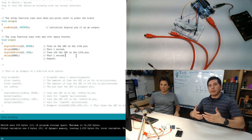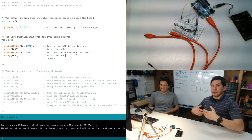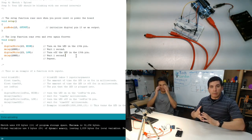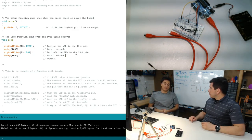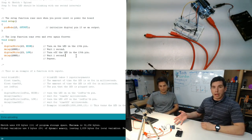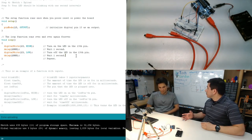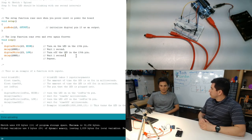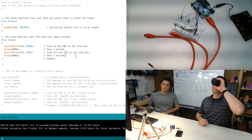Gotcha. So one of the only concerns is in the last time you saw when we tried to put two diodes together, the voltage wasn't high enough to turn both diodes on. Yep, they were acting like infinite resistors. Right. So if you are using a microcontroller that has 3.3 volt outputs, it might not turn on, say, a blue LED.